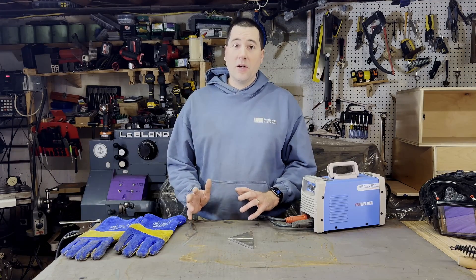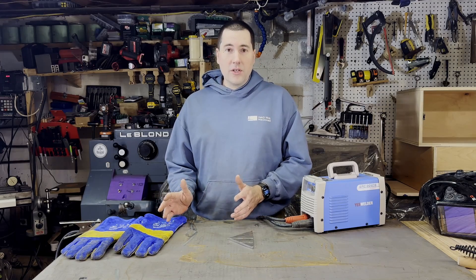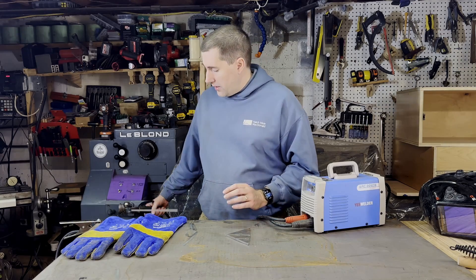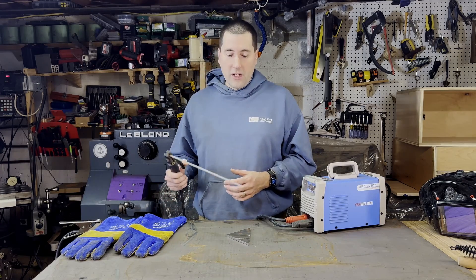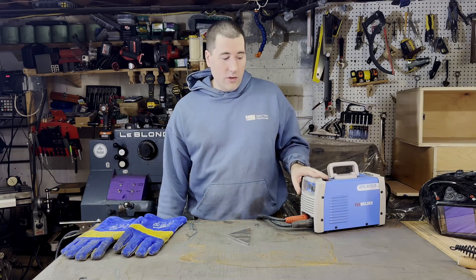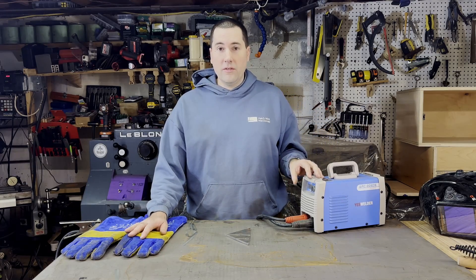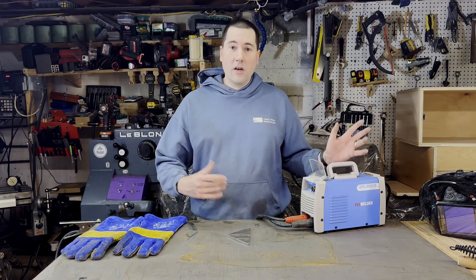I figured I should actually show you some welding here, despite how terrible I am at it. I've run a couple pounds of sticks through here, I haven't had anybody show me how to do anything — just learned by watching YouTube videos. I've done a couple projects and I've been able to get stuff to stick together, so it's been a bit of a success. So I've got just two little scraps of quarter inch steel with a little bit of bevel on them, and I'm going to weld them together. I've got a 6013 welding rod here, it's an eighth inch thick, and I'm going to have my welder set for about 130 amps, which is on the high side, but I found it's a little easier to get going when it's on the high side of the amperage range. One real problem I've had with this welder: this little plastic cover is very difficult to flip open when you've got welding gloves on — I wish they had arranged things differently so it's easy to change settings with thick gloves on.